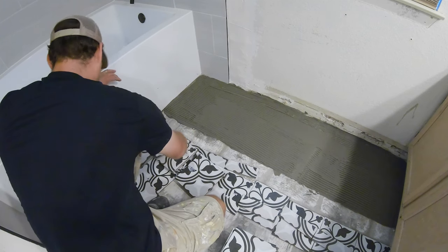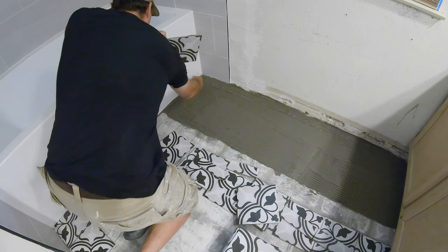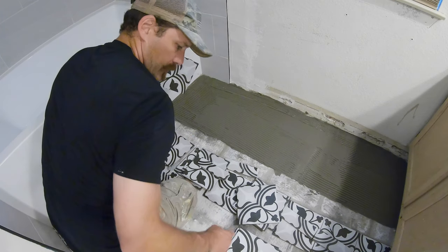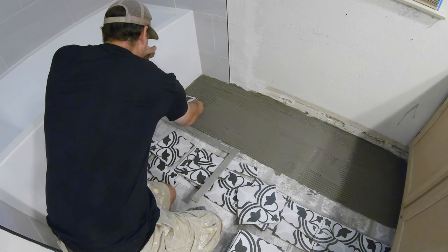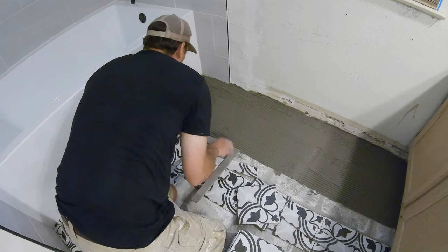Now I want to put my spacers in. I've got these tiles laid up — I've dry fit my front line all the way around so I know my spacing and how far off the wall to come. This is going to have base trim, so I've got a little bit of insurance here against the wall. With this line set up and my front line spaced properly all the way down, I can start pulling these and putting this first line in — bank in this line then patch back to the wall. I'm setting my thinset down all the way up to the line I just scribed to keep me honest and level. It's really exciting to get the first tile set in thinset — as long as we're on our line, we'll be good.